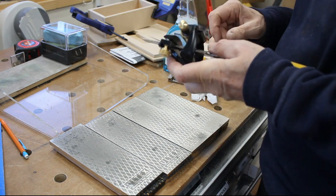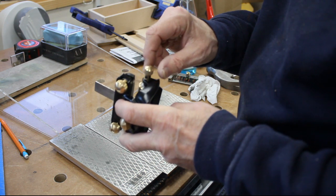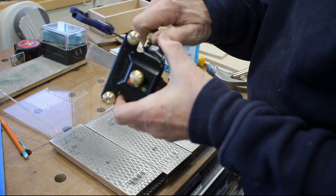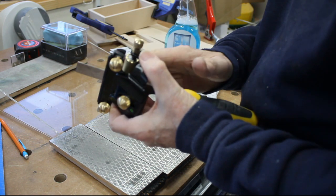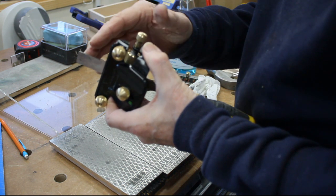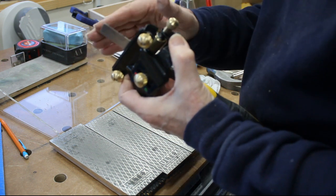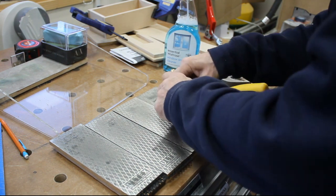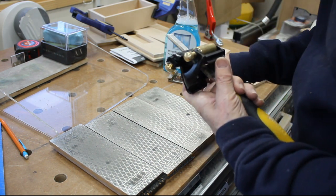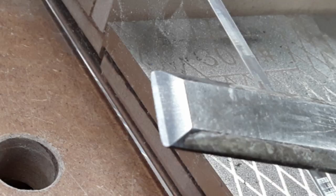The little 12 o'clock dial — you then move it to 9 o'clock when you want the secondary bevel. That just alters the roller very slightly in angle and puts a very slight secondary bevel on the very front of the blade, which brings you that last bit of sharpness. And you can see there's a separate line appeared along that now where the secondary bevel has kicked in.